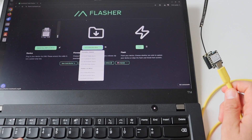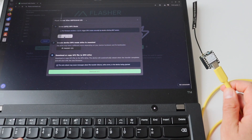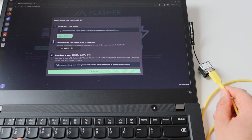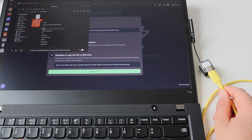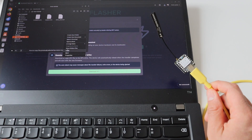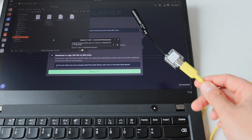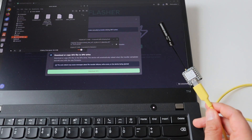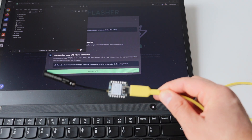At this point you'll see another pop-up from the Chrome web browser asking you to select the serial communication port that matches the Xiao Meshtastic kit. There will be a difference depending on your operating system. I'm a Linux user on Ubuntu 24.04, so the kit is recognized as /dev/ttyACM0, and that is the option I selected. Click the green button to enter DFU mode. Your Xiao Meshtastic kit should appear as a USB drive mounted on your computer. Download the firmware UF2 file and copy it to the DFU drive. Once copying completes, the kit will automatically reboot into normal mode running the version of Meshtastic firmware you just uploaded.